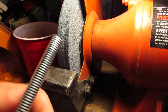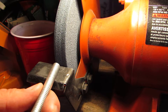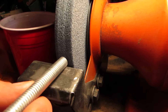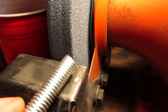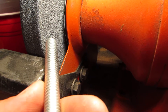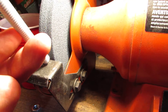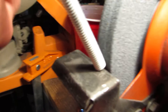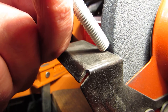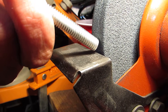So the obvious solution is to come over to the bench grinder. But I played with this for a long time. I came at it at an angle trying to get the burr off, I came at it straight on trying to clean it up. I know you're not supposed to, but I tried it on the side, tried twisting it that way — it didn't work. I finally figured it out, and the secret is holding it at just over about a 45-degree angle down, then turning it as it goes, and then slowly shallowing it out to clean up the end. I'm going to demonstrate that.